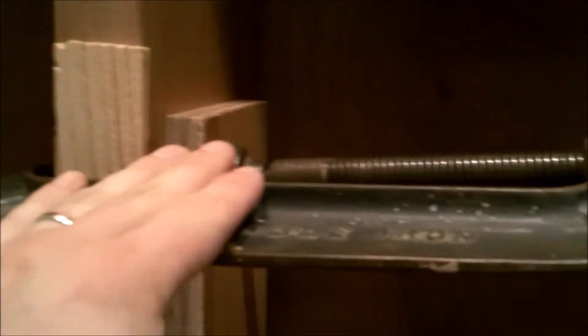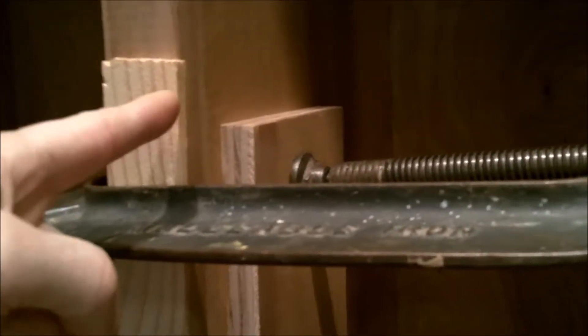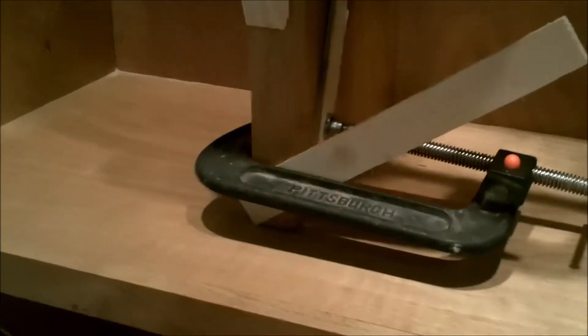This is a combination of apples to apples and headbands. What I'm doing is I'm clamping a board on each side here and that locks this in place as a horizontal thing I can push against, to push inward because I don't want to show any fasteners, I don't even want to have any fasteners. So I'm just gluing it with some nice wood glue and then I put shims in here to apply pressure at any point where I don't feel like it's gotten pressure, and I'm testing that by listening for the glue to go squish squish when I push in at various points. So this one's squish squished all over the place and I had to have a whole bunch of pushers there.